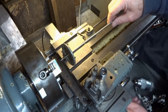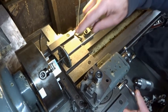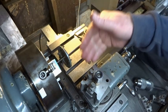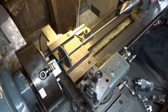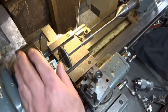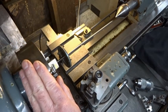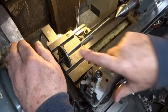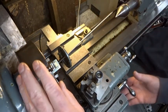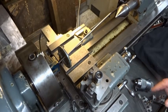The centre part of the wobbler is such that it is aligned so this point is at the centre height of the lathe. If we bring the tailstock up with the rotating centre just for a point of indication — hopefully you can see this centre pop is not in the middle by a country mile, and you can see that the pointer is wiggling about a fair bit.